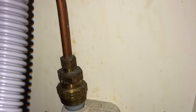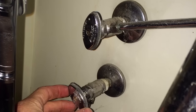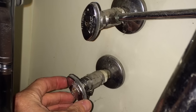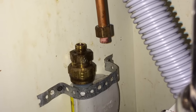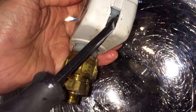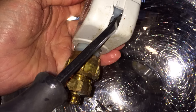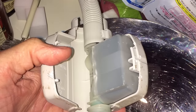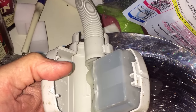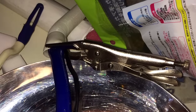There's a small nut we're going to remove at the top of the valve, but first make sure you turn the valve on the wall all the way to the right as many times as you can until it's fully shut, so we don't have any leaks. Using a pair of pliers or a crescent wrench, spin this nut off the old valve. Using a flathead screwdriver, pry the plastic case off the old valve in three or four locations to work it loose. Now we've exposed the parts we need to change. Push back the white pipe and hold it with a vice grip so you have an area to work.